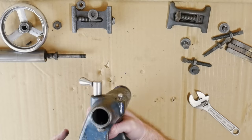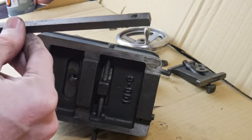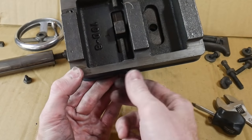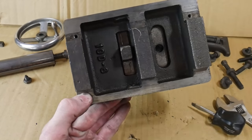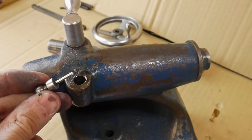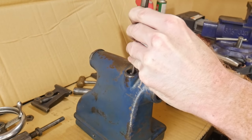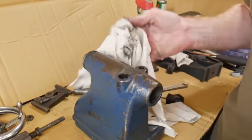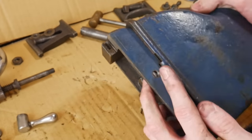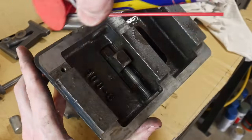The first thing I did was get some of the easier components off to get my feet wet. I took apart the steady rest and the tailstock. Throughout this process it becomes apparent this lathe has not been taken apart in decades — not only is it filthy, but many components are semi-stuck with either grease or rust. On the tailstock, the bottom section is actually two pieces, and those set screws allow the user to move it toward the wall or toward themselves. They would not come apart with a soft-blow hammer, so I used some spacer material and threaded screws to push that bottom piece off.